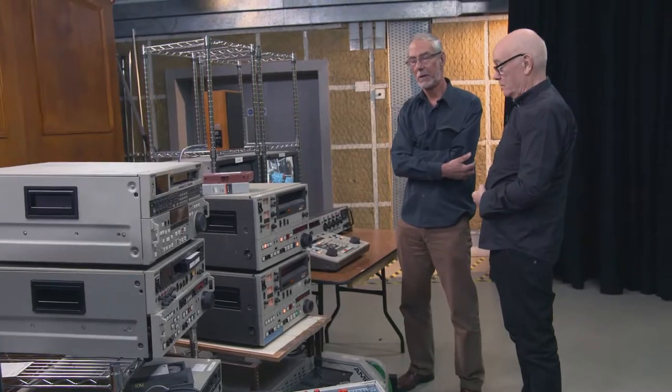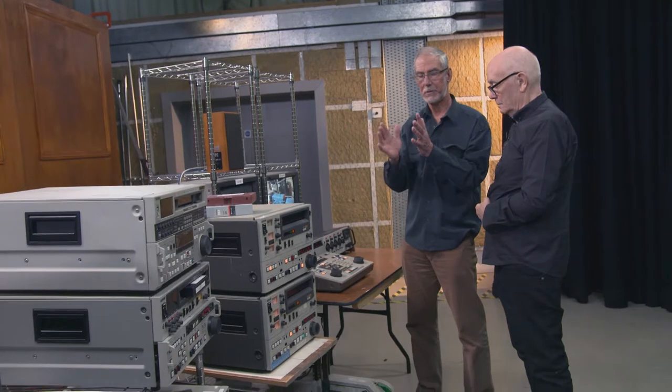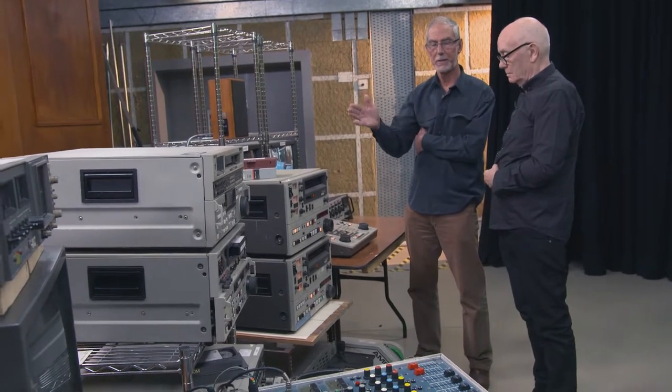That was 1969. You can talk about the rollback and mix — that was done because post-production had no video mixing or wiping in those days. When we did shows like The Good Life in the early 70s, the studio had a vision mixer obviously, and what we would do: there would be another machine, so you'd have three machines downstairs in VT — two of them would be recording because we always had a main and a backing — and you'd have another machine which was the rollback and mix machine. You'd come to the end of the scene, stop, there'd be a costume change or whatever, and the rollback and mix machine would go back beyond the last cut in that scene.